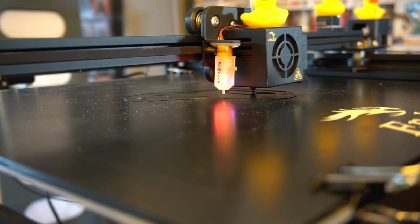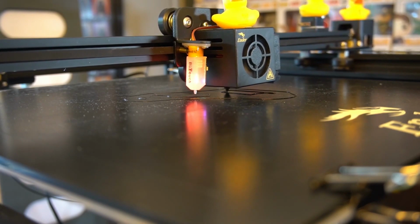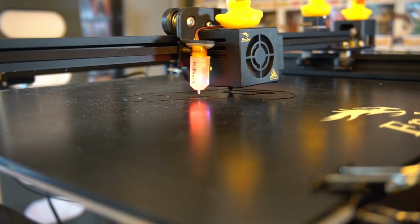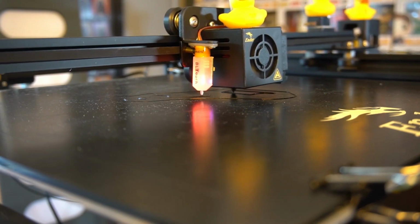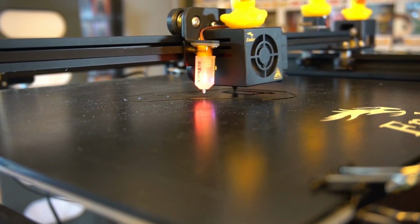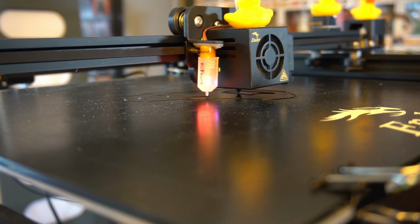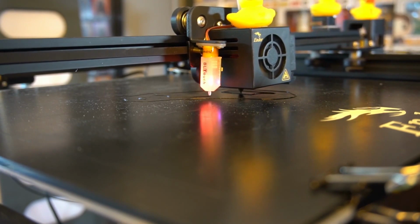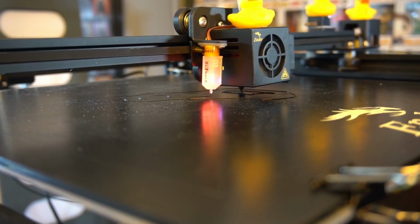In fact, it's actually pretty good, and if you look back to the beginning of my video where I had the filament seepage coming out the top, it was basically down to whoever actually built this at the factory hadn't done certain things up properly, and even the thermistor was over tightened, which was causing a short to the board as well. So once I kind of figured out exactly what some of these problems were and how to fix them, this is kind of a good route forward if you're just looking to do the board, do the drivers, quieten the thing down. This is a good route forward, definitely, I would say, for you.